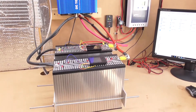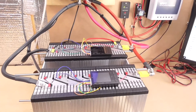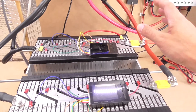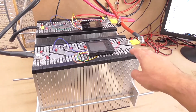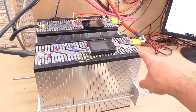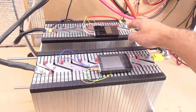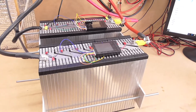I was talking about upgrading the batteries, which I've done. I had the batteries originally for a seven series, five parallel bank of batteries, which worked nicely — so nicely I thought I'd do the same again. So we've got two banks of seven series, five parallel. Each cell is 20 amp hour, giving 100 amp hour at 28 volts per bank, and another 100 amp hour at 28 volts for the second bank. So 200 amp hour, just under six kilowatt hours in total.